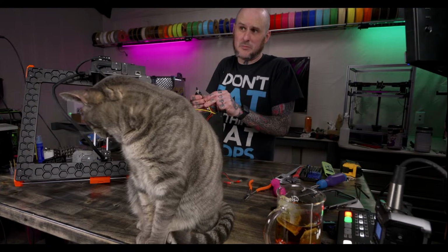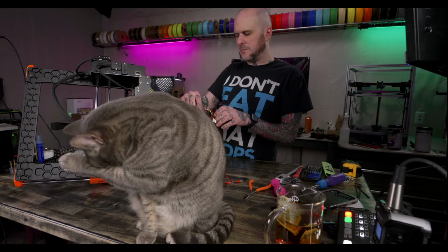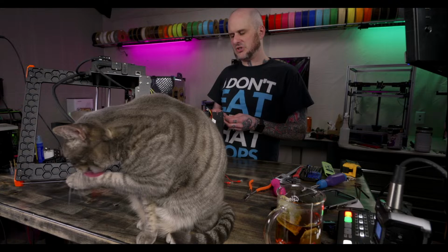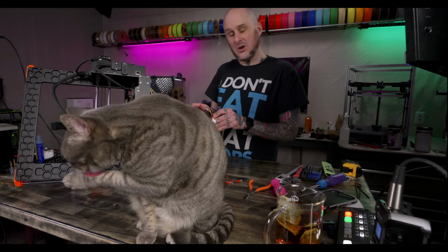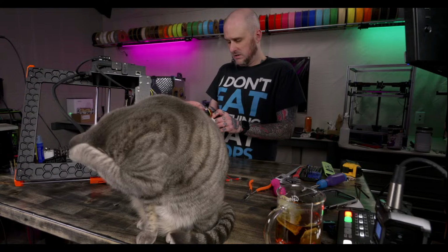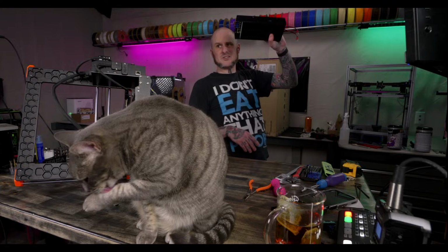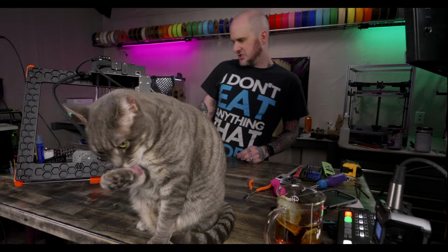Aren't Prusa parts PETG? Wouldn't they warp in an enclosure? They have the potential to. The enclosure is rather large volumetrically compared to the size of this machine. I don't expect high temperatures out of this whole setup. The parts are available. I can always reprint them. I could always reprint them in ASA, which I may eventually do. Power supply is off, and I get to remove the screen now. There's a handful of M3s underneath here.